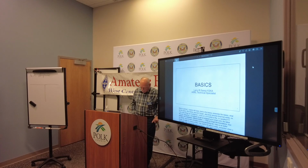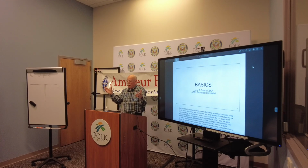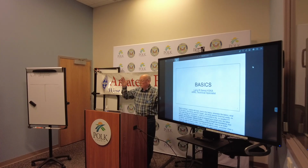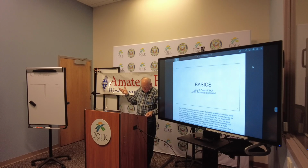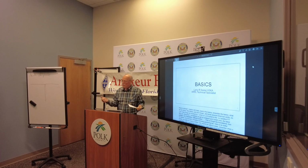So it's not perfect. Think about things as perfect conductors. They're not. The Earth is not a perfect sphere, and on top of that, it's not in free space. We operate in an atmosphere. You got objects in proximity, vegetation, buildings, different things. You got hills, so it affects that. Even wires. We talk about them, we think about them, we calculate things, but they're not ideal. They've got resistance, and their velocity of propagation on a wire is different than free space.